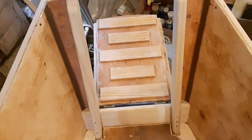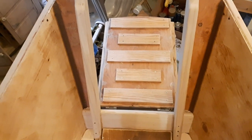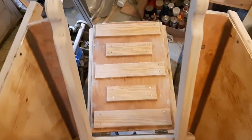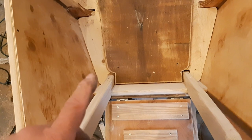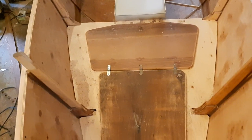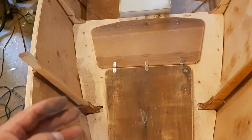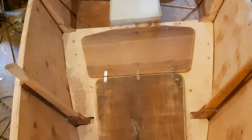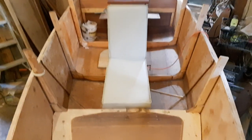I'll reflect on the step-through design: when fishing with buddies you always have to haul your leg over the sides. I like my pram bows, and the reason for them is I build with two center frames, which makes for a ridiculously strong hull and means I need no forms. These egg-crate together — fillet the seams, get it all level and square, and there's your framing set up. It was built upside down, as you'll see.